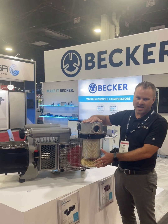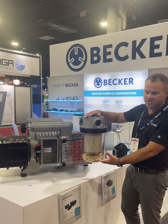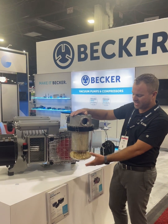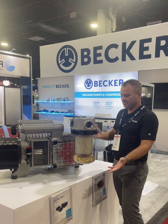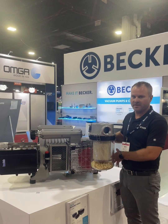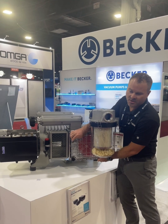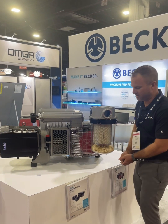We have a knockout filter in front with a polycarbonate housing. They're super easy to remove and give you a visual of any debris that collects inside. This is a good representation of how much debris can end up in here — it can fill fully before you need to remove it. On top of that, we have an integrated filter that comes standard on all of our pumps, and this filter can handle both the mainline or the relief air — it's actually doing the relief air regardless.